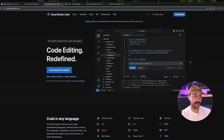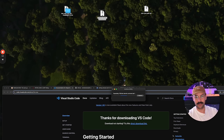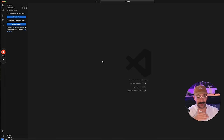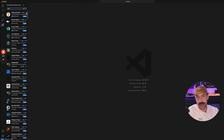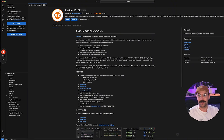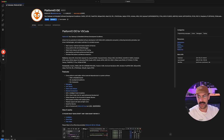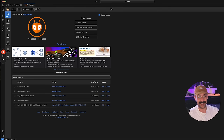Next, install Visual Studio Code — a code editor most of the world uses nowadays. Download it for your operating system, unzip and run the installer, then open it up. Go to the extensions icon on the left and search for 'platform' and you'll see PlatformIO show up. Click install. Once installed you should see a little bug icon appear on the left — click it, then click the little house at the bottom left to open the PlatformIO home screen. You're now ready to flash your ESP32.